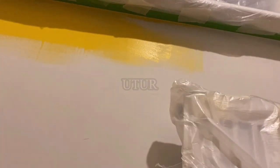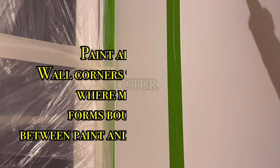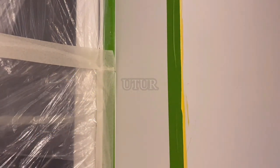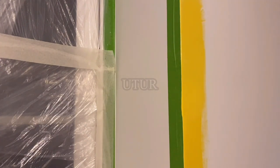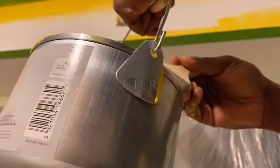I have used frog tape on the inside of the window's recess because I want to minimize the impact of the eggshell yellow paint that's been painted on the outside of the window's recess — on the inside of the recess. If the yellow eggshell paint spills over and cures on the inside, it can be quite difficult to get off because you need to sandpaper it. And even if you decide to paint over it with a different eggshell or matte paint, you will still see visible lines.